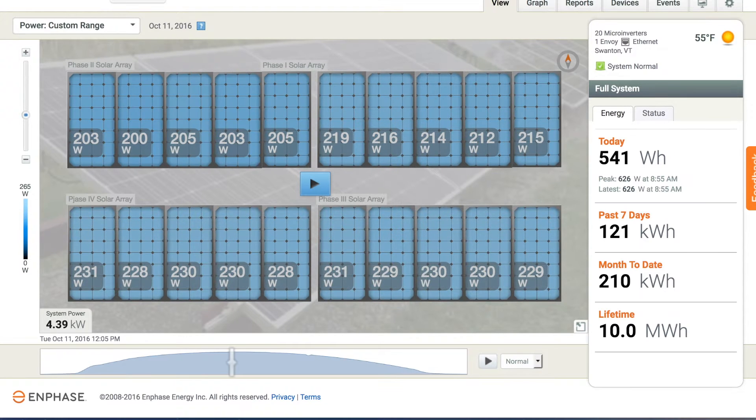The next day we had pretty good sun — the panels were a little dirty, and I came home and washed them off. We didn't quite hit peak; solar average was roughly 230W. My M215s and M250 are roughly the same power as the rest of the M215s, which is matching up about the same as my M250s — so back to the same issue of M215s outperforming the M250s. I'm now thinking sun intensity plays a role, and the issue may be in the trunk cable or perhaps the Cineva panels aren't performing as well as the SolarWorld panels.